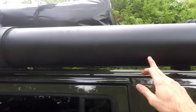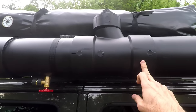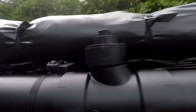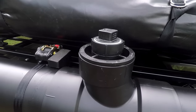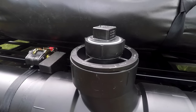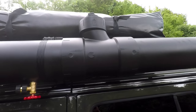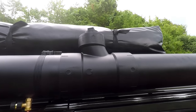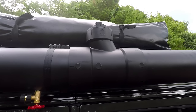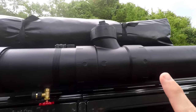Coming from the six-inch PVC pipe, it goes into a six-inch by four-inch T — both ends are six inch, and this is a four-inch T up here — which goes into a four-inch to two-inch reducer bushing, then into a two-inch cleanout. That's where I unscrew it and fill up the tank. I had to Teflon tape that cleanout because it was leaking air just a little bit — not a lot, but enough to decrease the pressure noticeably. I unscrewed it today and the Teflon tape still seemed to be good, so I don't think I'll have to redo it every single time. But just be aware you'll need to Teflon tape it to keep it tightly sealed.